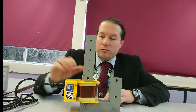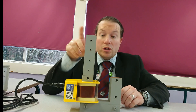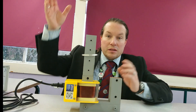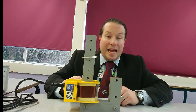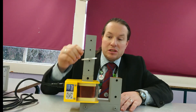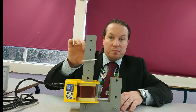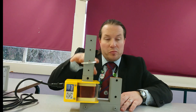If we look at the transformer now, I've removed the secondary coil and turned the top of my laminated iron core vertical. I'm going to take this solid ring, turn the transformer on, and just drop this over the top. Magnetic levitation! What's happening here is gravity is pulling the ring down, but because it's a complete ring, we're getting an induced current. That induced current goes around the ring in the direction that causes it to oppose the magnetic field and the motion, pushing the ring up. Our magnetic field then changes direction, so it starts to move down — and that's going on every 50th of a second, which is why it's vibrating up and down a little bit.